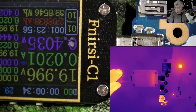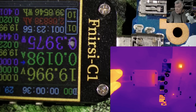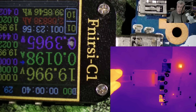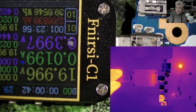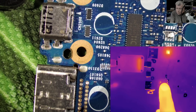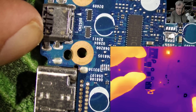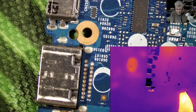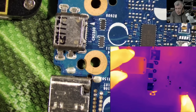The PD controller chip is working, taking 20 milliamps, and the thermal camera is able to detect that 20 milliamps — which of course is shared across more components, not only that chip. Check this out to understand how sensitive it is. Now plug the charger back in.